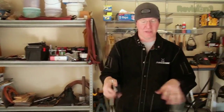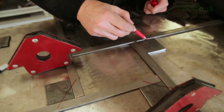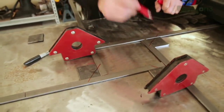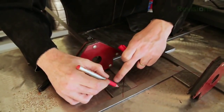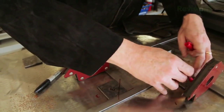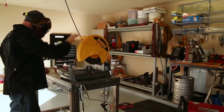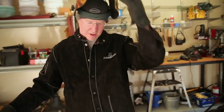If you want to be really clear about how you have this, take your marker and draw an intersecting line across each one of these pieces. That way we know where to put them back together. You could also number them - one, two, three, four - and mark corresponding numbers on your table. We cut all those things and lined them back up in their respective places. We're going to tack weld them, but first we need at least one piece to be stable - so I'm going to tack weld one to the table.